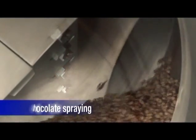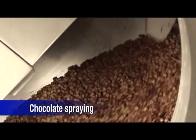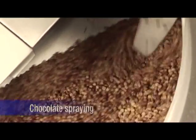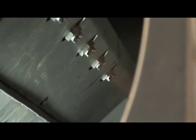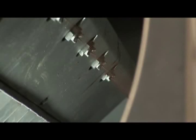Chocolate is melted, then pumped through a motorized rotary filter onto the double-jacketed spray arm. In order to have a very fine spray, the air spray guns have been specifically designed to have hot water jacketed circulation. This allows the most delicate process to be achieved in the minimum of time without nozzle blockage.